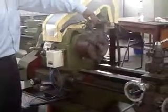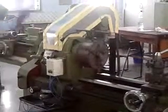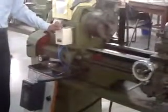Now we will put the chuck key on the chuck. If you switch on and press the button on the starter, the machine will not start because the sensor is detecting the chuck key on the chuck.